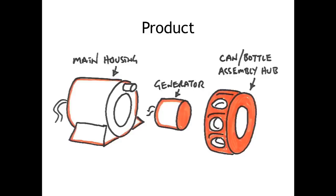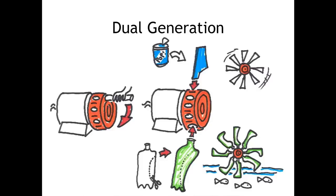We broke these down into a schematic — basically you'd need to develop a housing, the generator, a little bit like a dynamo, and some sort of hub that would allow you to mount either tin cans folded up into turbine blades, or using the screw cap fixture of two-litre water bottles that could be used as a sort of water wheel. This shows the duality of using not only wind power but also water power. We also realized that if these were stopped or unavailable, you would still have the ability to hand crank this and give extra power generation in a time of need.